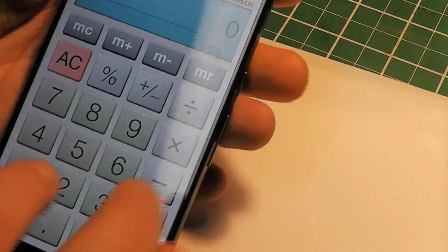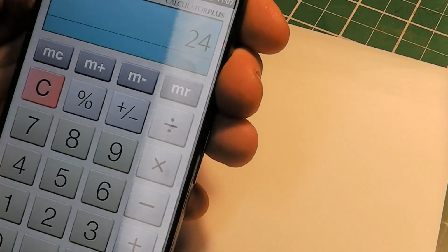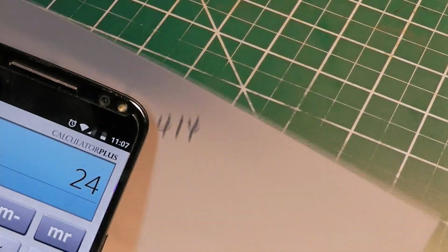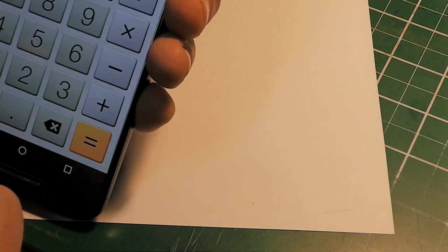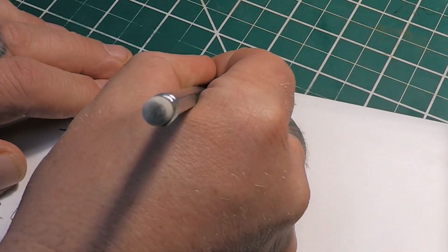There's your voltage. Okay, but let's say we've got 24 volts. Let me get a calculator. Alright, let's do it this way. Say we've got 24 volts RMS. You've got to remember, this is going to bring it up to the peak when you rectify it and put a big old capacitor in there. So 24 volts, you take the voltage times the square root of 2, we'll round off to 1.414. That's why that was written on the paper there. So times 1.414, right here you're going to have 33.9, we'll say 34. We're at 34 volts right here, and you've got a 24 volt transformer.